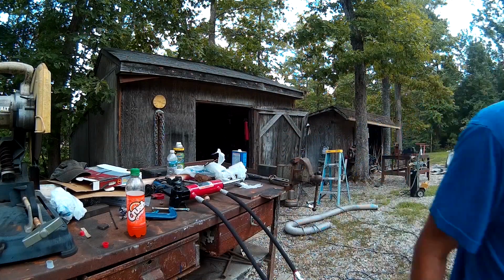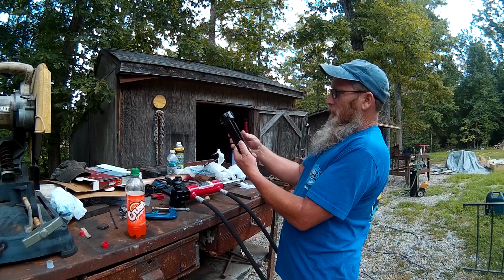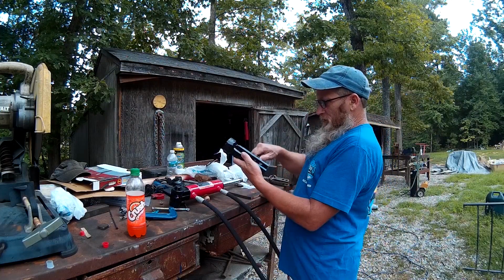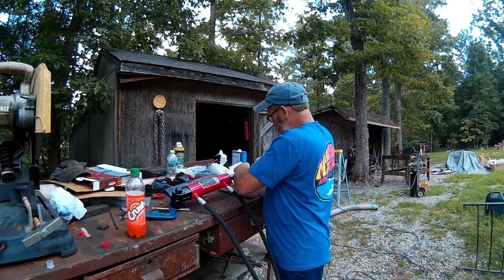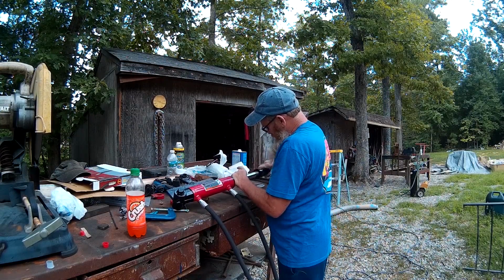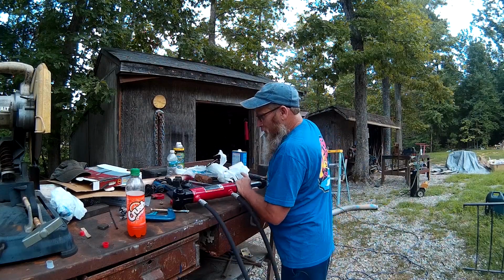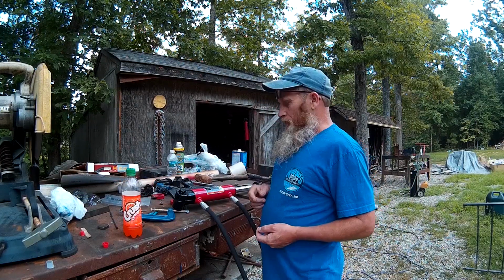We go over here and get the bottom part. Okay, so here's the bottom part. We painted that up. Got it welded on, looks good. We ground the sides off a little bit on each side so that we had enough clearance to get this all the way through and get the pin in it. So that worked out good. So we're going to go ahead and screw this up on here. All the way. Let's go ahead and take this over there, mount it up on the tractor.